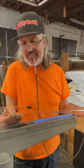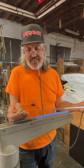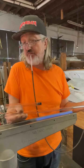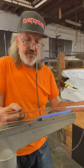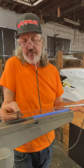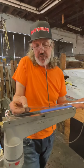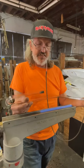Of course the end of the glass is very hot. I'm heating up glass close to my hand and I feel no heat right now, but by the time I'm done bending this, some of the heat from the end of the glass will have traveled to where my hand is. And some of the heat from the new glass I'm heating up will travel too, but I have probably just enough time to complete what I'm trying to do before all that happens. I can feel the heat coming over now.